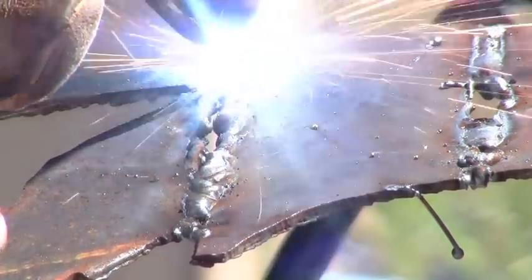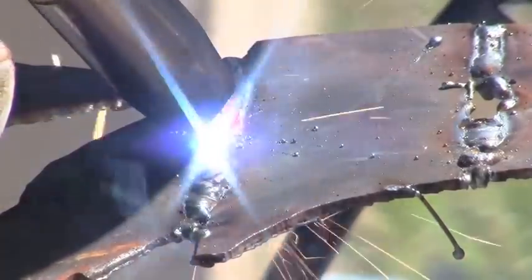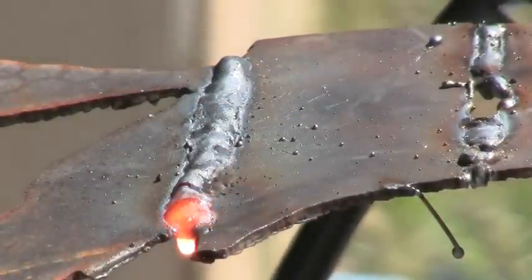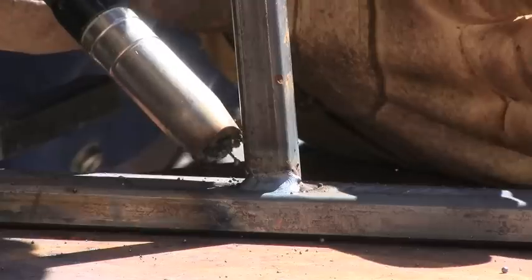So I turned the machine up right now and I'm just going to go back over. I could turn it hotter probably. I'm going to go in the middle there and try to melt it all together. I stopped there because it started melting through, so I was letting it cool off before going back in. If you're going to MIG weld stuff that's not just for looks, I'll make some videos about beveling and getting complete penetration and what to look for if it's done right. But for this, you're going to grind that off and smooth it up with a flat disc anyway, so it doesn't really matter that much. Thanks for watching.